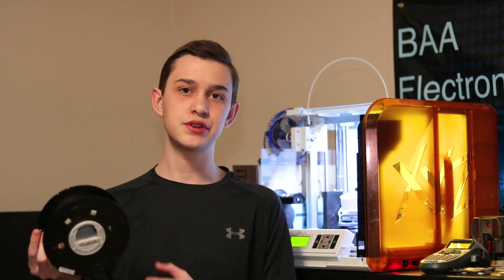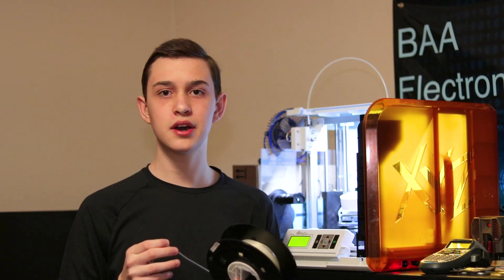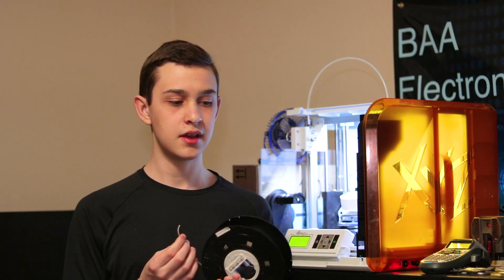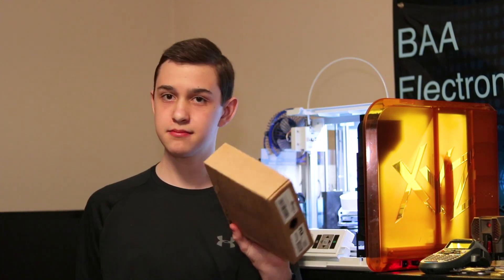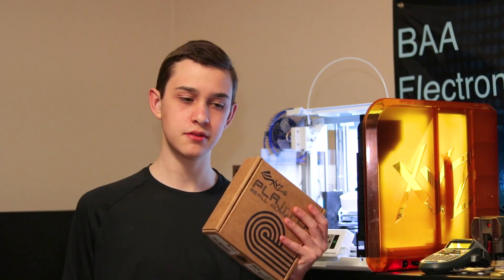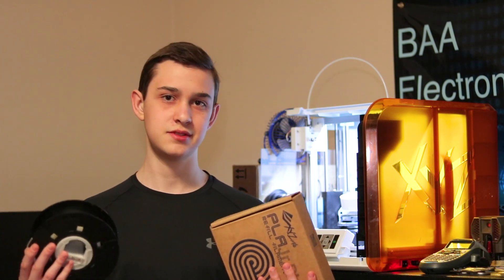Your filament type really does matter for print quality. The nature-colored filament — which just means translucent, no dyes, no color — is the filament I've found to be the most reliable when printing, mainly because it doesn't have any dyes or thick additives to clog up the print head. I've used black filament and white filament, and they both yielded terrible results most of the time. The clear green filament I've also used and gotten pretty good results, mainly because the dyes aren't that thick opaque kind. So I definitely recommend the nature-colored or clear green filament — just any of the translucent ones.